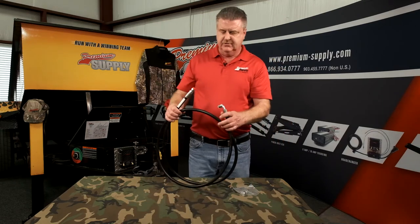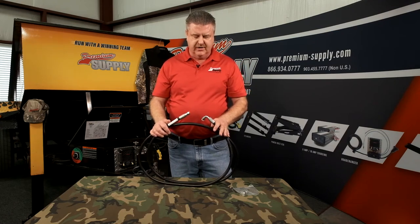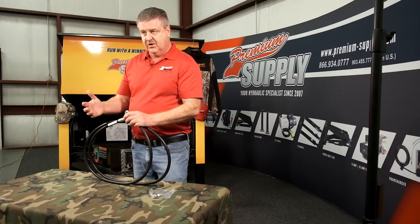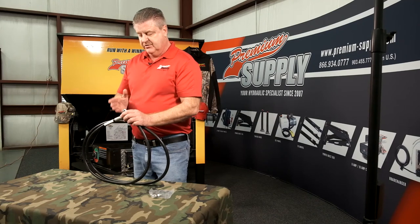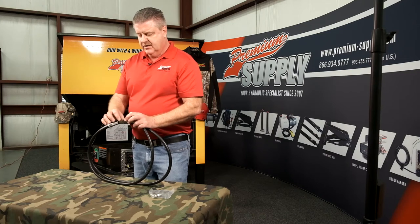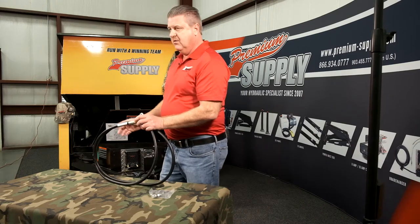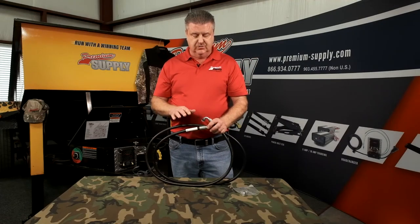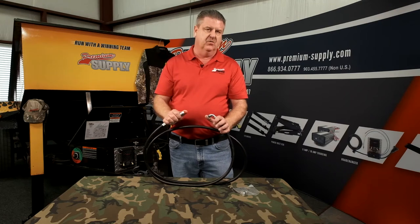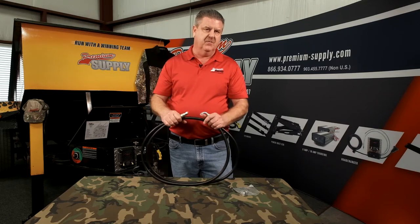A lot of people like to make their own hoses and we do have a hose crimping machine in-house for custom hoses, but typically we have them brought in from a supplier pre-made for the majority of our standard kits. The company we get them from is called Pressure Connections. When they cut the hose — and if you've ever cut a hose, it's very similar to cutting a tire — there's metal, rubber, and then the metal of the crimp itself, which is very contaminating. If that ever gets into a valve on a pump it will cause problems. So you need to blow a projectile through it to clean it out and then put caps on it until you're ready to use it, so you know your hose is totally clean.